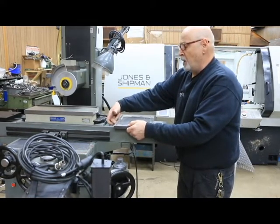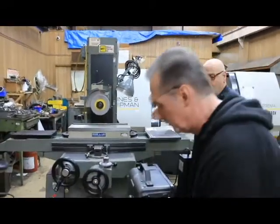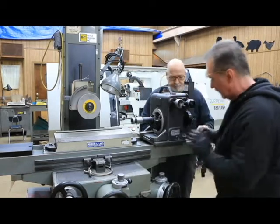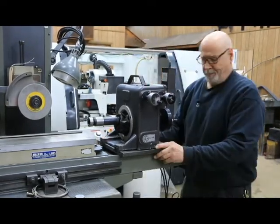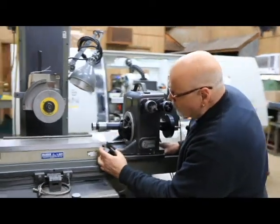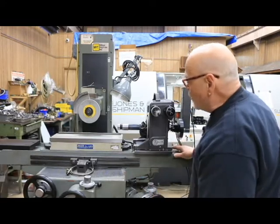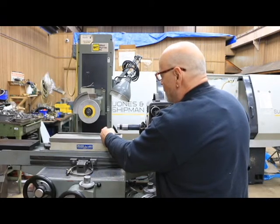You're going to need some kind of a spacer over here. I'm going to ask my assistant John to pick this whole thing up and grab by the lens and set it right down on that edge there. Once you get this up on the machine, you have to bring this in until you establish approximately a three-inch distance from here - you don't want to be any further away. You could probably go up another three-quarters of an inch if that's what you want. Bear in mind what I said: you only have about a four-inch spot where this thing is going to be in focus, somewhere out here by my finger - that's where you're going to have to do your grinding.